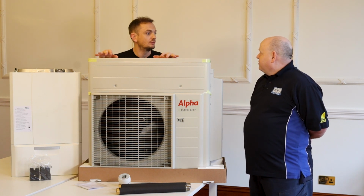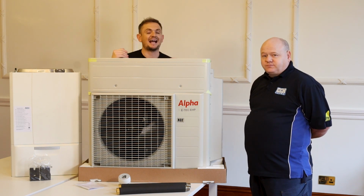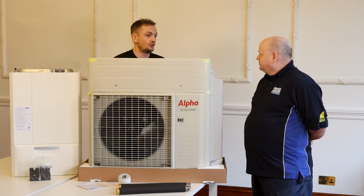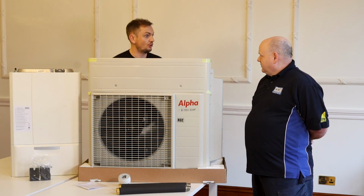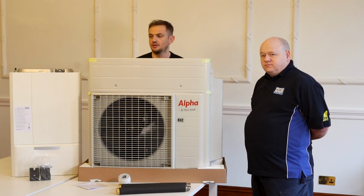What about this, what people are talking about now with the hydrogen ready? So hydrogen ready? So yeah, the boiler is hydrogen blend ready. So when you hear hydrogen ready, it could mean two things. 100% hydrogen burn, which there's only 2 products in development at the moment for that I'm aware of that will do 100% hydrogen. But we went to the hydrogen home, didn't we? Yeah. One was Worcester, one was a Baxi. I think Vaillant might have one actually as well.